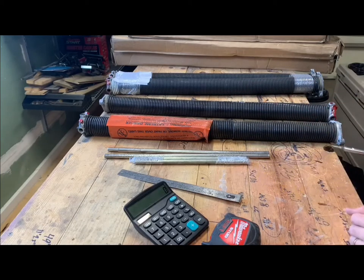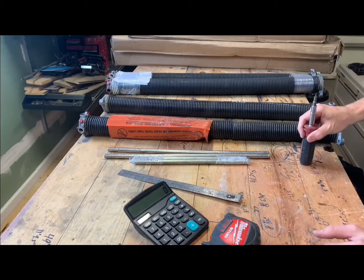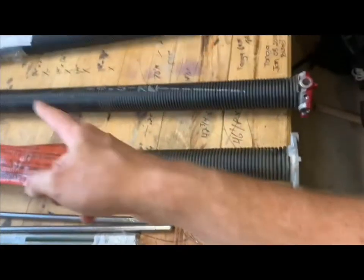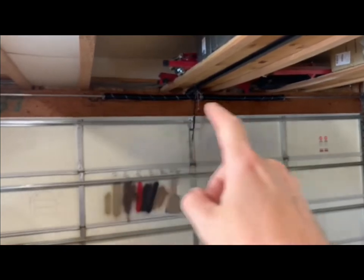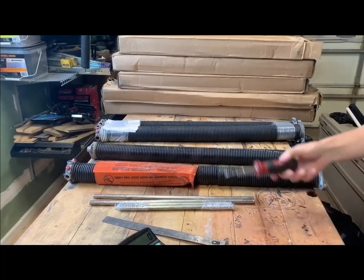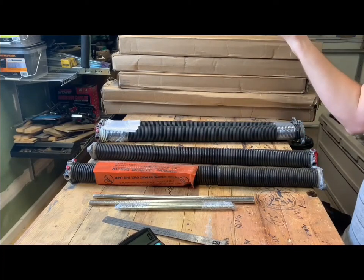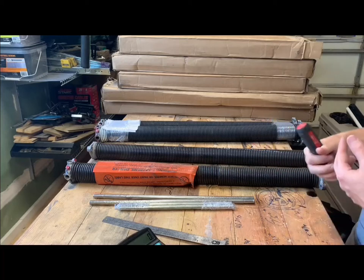What I mean by upcycling is you can take a spring and get one that looks maybe one and a half times bigger but is the same amount of strength — it still opens your door the same — but because it's dispersed over a bigger workload it lasts significantly longer. For example, the springs I replaced on my garage door were about 30 inches. The ones I put on are each 40 inches and two-inch inner diameter. Technically the same strength, but they are rated to last 10 times longer. On Home Depot, those standard springs are about 60 or 70 dollars and the upcycled ones are about 80 dollars — a 10 to 20 dollar difference for 10 times the lifespan.